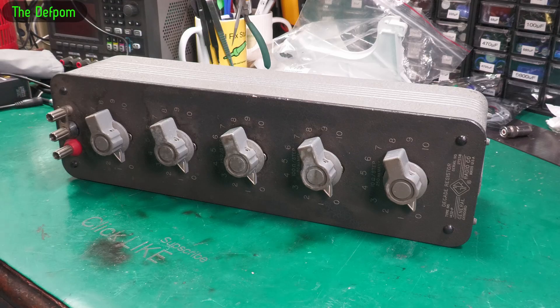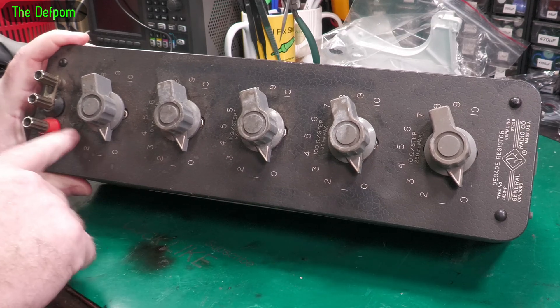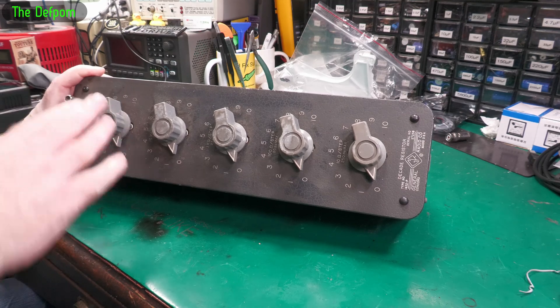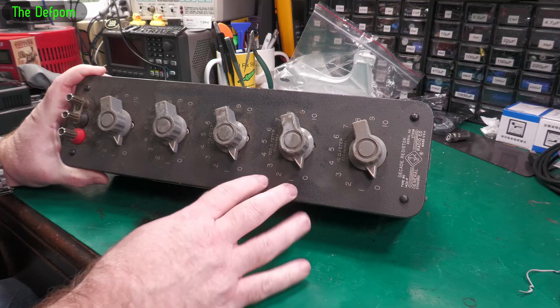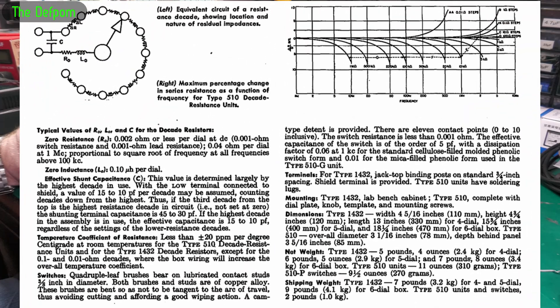I know it does basically work — I've demonstrated that in the mailbag already — but let's look inside it and see what's actually in there. So you can see this does 10 ohms, 100 ohms, 1K, 10K, 100K in decades, so I can go up to like a basic 1 meg. The thing about these is these are precision resistors. They're high precision. I don't remember offhand what they are; I might have to look it up. Maybe I'll put it on screen and say what the precision actually is, the accuracy of this thing.